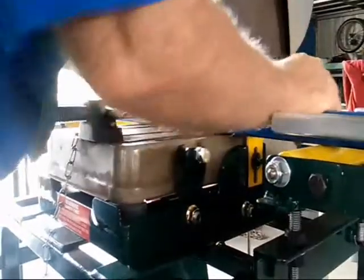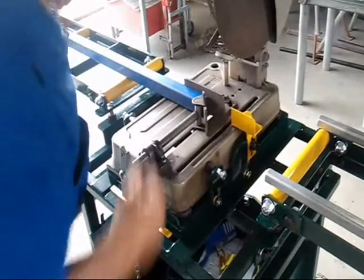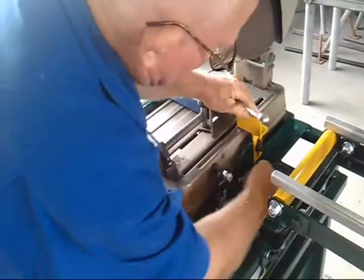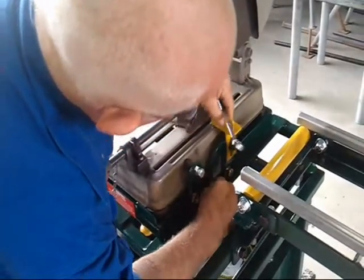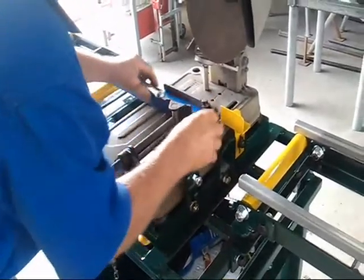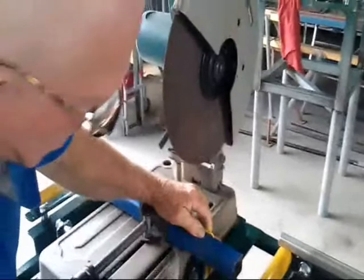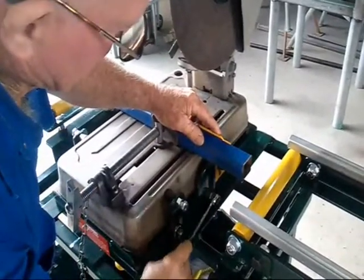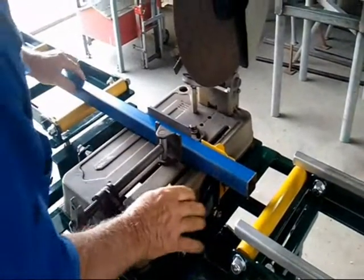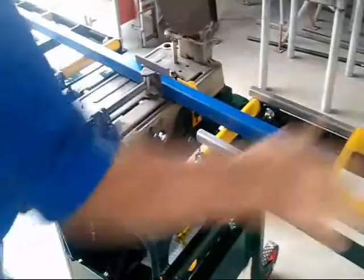Put that on there like that. Now I can, yes, I have to adjust this one. This is a bracket that fits to the turntable that holds the kickback stop, and that's adjustable, so when you put that in to your back vise, you just slide that up to it and then retighten your nut. Now, 20 or 30 of them, I said, away you go. You just bang, nothing can happen, take them away, feed another one through.